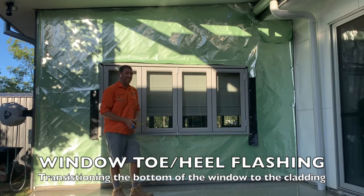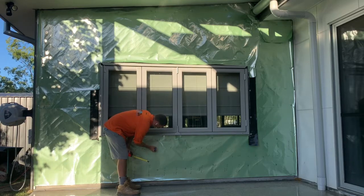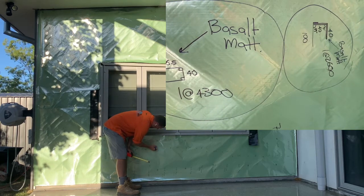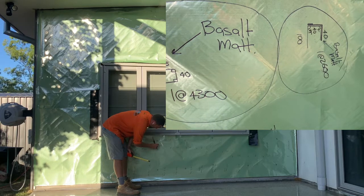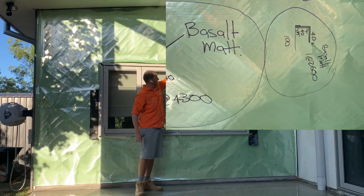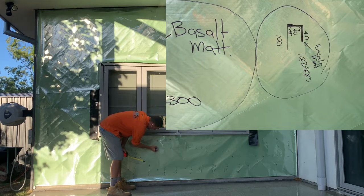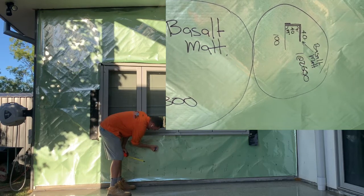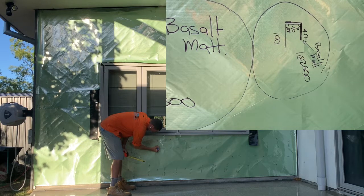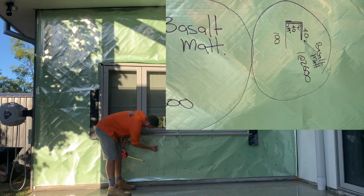So how do we do that? Well, it's a little bit of a trade secret. I do a little fancy flashing that comes up the wall. Remember that 100 that I keep talking about? 100 mil. Comes across the thickness of the sheet, which is going to be the same as the thickness at the top. We have this one here, which is 40 mil. So this one here is going to be coming across on the inside 40 mil also. And then we're going to have it come down 40 mil, squash fold all the way back up, return in 40 mil,